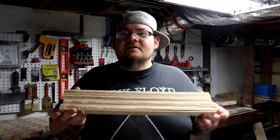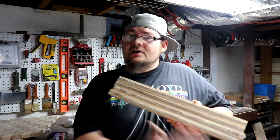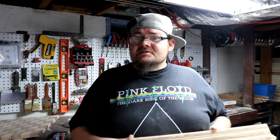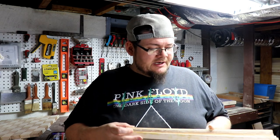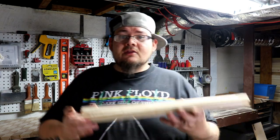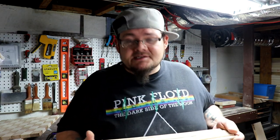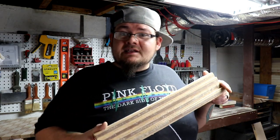Our strips are all done drying — I left them clamped for about 10 or 15 minutes. I was running sawdust over the top of them as I was gluing them in to fill in any imperfections or tiny little gaps. Looks like it did the job wonderfully. This is the same technique I use on the boards when there are any gaps, and it works great. I took them out of the clamps so they wouldn't glue together since some glue did leak over onto the sides, but they clamped down well and look good. Disclaimer — I'm not a professional, I just started doing this stuff. This is my first inlay and I think it's going to turn out really well — everything's going perfectly so far.